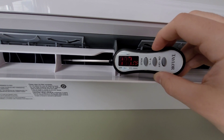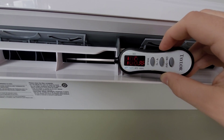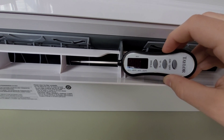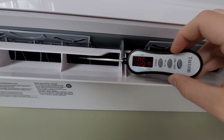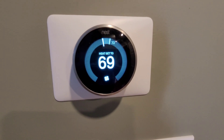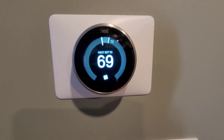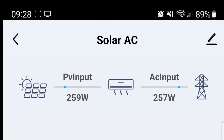The unit has ramped down now. Taking another temp reading — we're still coming out around 106–107°F. We're set for 75°F and the indoor temperature is at 75, so the compressor ramps down. It's variable speed. I've set the gas furnace down to 69°F and we're still holding at 72°F. It's about 9:30 now and we're about 50/50 on input — getting a good amount of sun, and in just another half hour we should be on full solar.